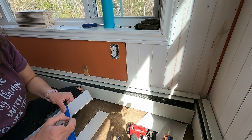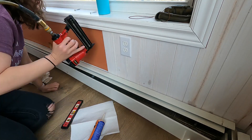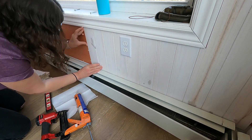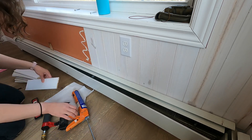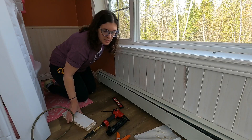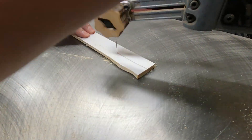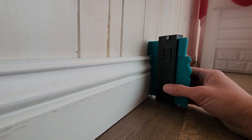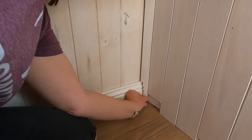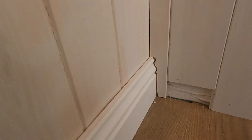One thing I wanted to mention is that I used a combination square to mark out all my outlets. I use a combination square for so many projects, and if someone asked me what tools they should buy to get started, one of my number one things would be a combination square. I was glad I waited until morning to finish up this project, but it still took me a few hours to finish. Once I finally got to my last piece, I had to scribe the piece to the molding using a scribing tool, then drew it out on my piece and got back on my scroll saw to cut out the profile. Once I got this piece pushed into place, it was time to put the baseboard back on and my corner pieces.